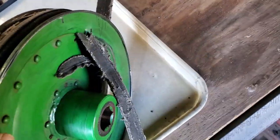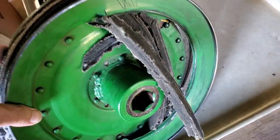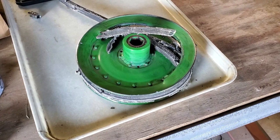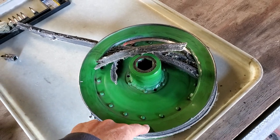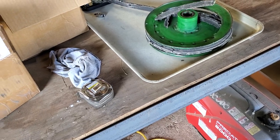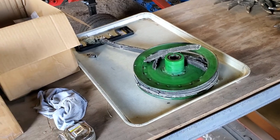Obviously this belt is shredded — it got shredded and went through the side of the pulley. I went to take the belt off and said, 'Look at that.' He said he'd never seen it. The belt basically sheared and ripped apart the pulley, popped the rivets. They had a new one and I put that on yesterday, got it all tensioned. The new one's cast iron with a big broached hub. The pulley was about five hundred dollars and the belt was a hundred to two hundred. I had also fried a belt prior to that, which probably had something to do with this, so I'm hoping there's not an underlying condition.